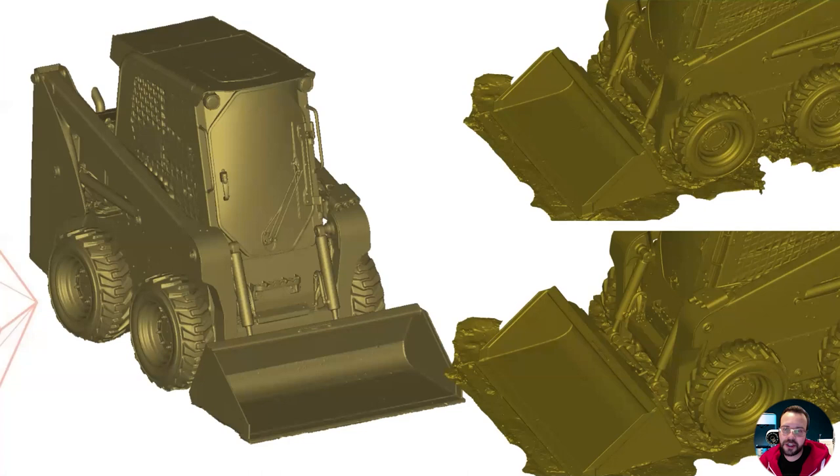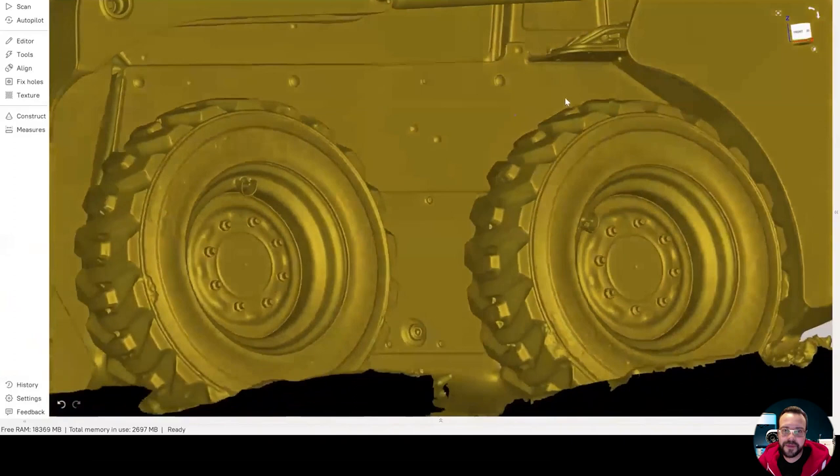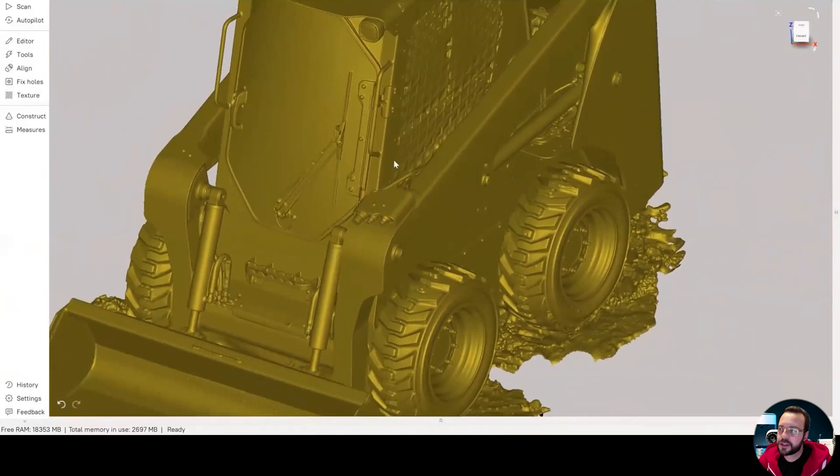It took us about two hours to scan the entire vehicle, accumulating 84 GB of raw LEO data throughout the scanning session. For this project, we chose to record every fourth frame in HD and set the HD density parameter to 2.56 upon importing into Artec Studio. The processing took place on the same computer as for the Mercedes — the i9-7900X CPU with 128 GB of RAM and an RTX 3060 graphics card. The HD reconstruction time for this vehicle took about two and a half hours. Here, same as for the Mercedes, is a short screen video of the vehicle showcasing the results we were able to obtain.